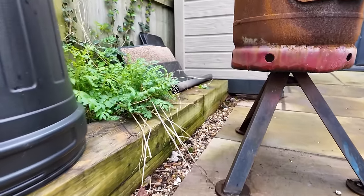After that, I need to think about the plinth I'm going to be installing the tank on. Do not start trying to install these tanks on a couple of patio slabs. Best thing you can do is install a proper concrete plinth. The regs for a plinth: there has to be a 30 centimetre overhang on every side of the tank, and a depth that will adequately support the weight of the tank — normally about 100 mil, but I'm going to put 150 mil in, which is 6 inches. That should be enough for a tank installed within regs, nice and safe. The tank is bunded anyway, so you don't have to worry about it leaking everywhere because it's going to leak into itself.